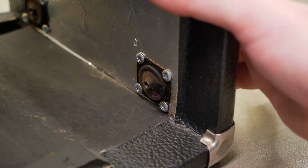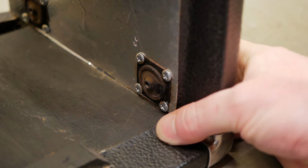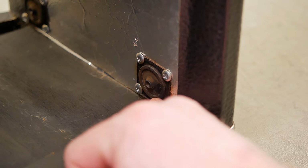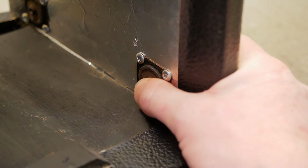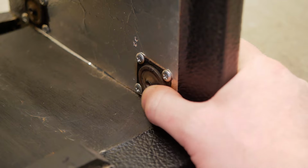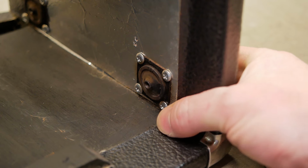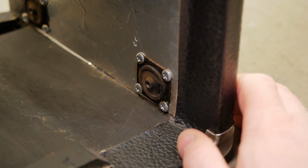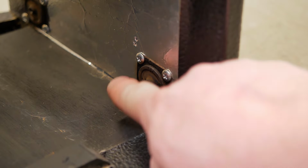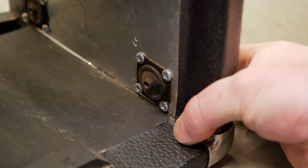You can see here the little rubber gland things that suspend the chassis. Shock absorbing. They've got a pressed metal plate on the bottom that holds that washer captive, which has actually got a metal sleeve in it that the screw engages with. They're pretty good, but the rubber, it's a good idea, but the rubber tends to go brittle after a while and eventually they fall out. And I'm not sure that's available as a replacement part. You can see there, it's just screwed into the timber there. Large oversized hole and then just four screws, but that's more than adequate.